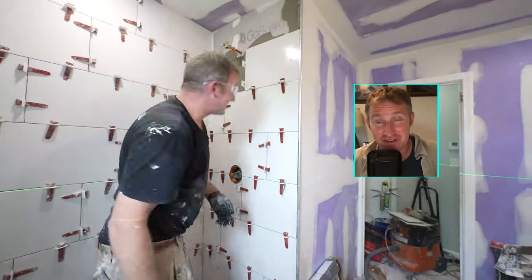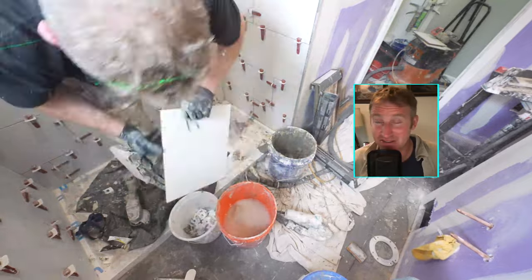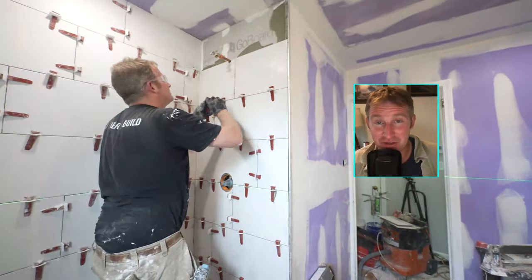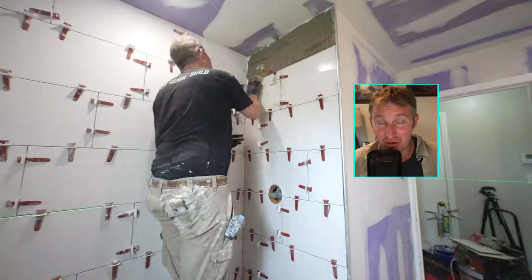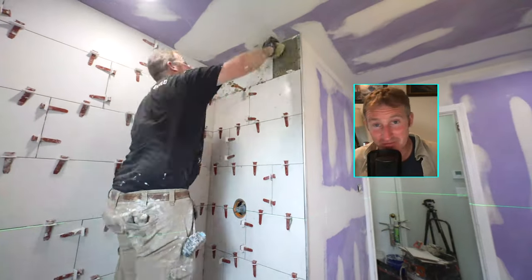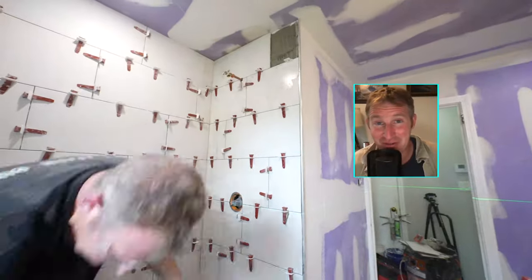And then as far as the shower head, in this instance, it was pretty easy. I was able to just notch out a little square, but you might want to get a 1-inch tile bit as well, if you're in the middle of the tile. But other than that, we'll be able to finish this up and you'll get on to the grouting the next day.